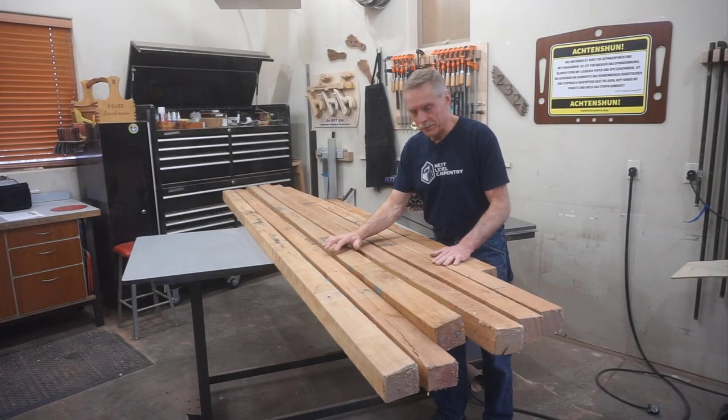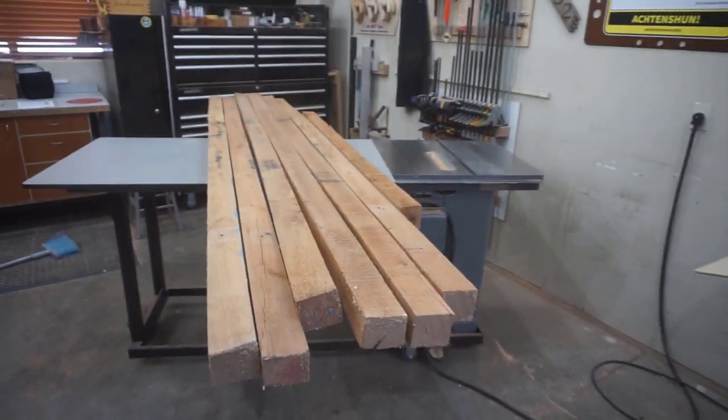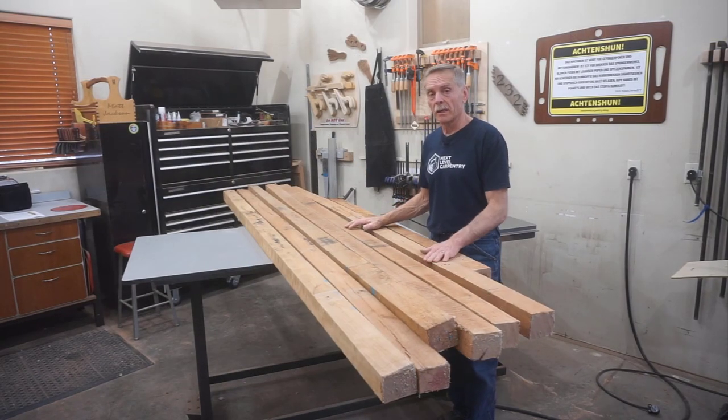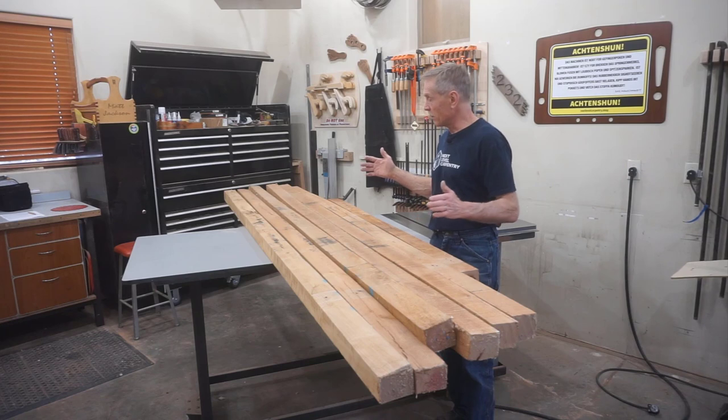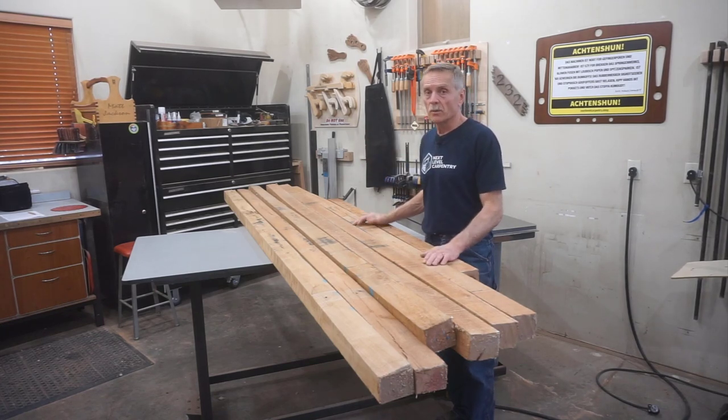Well, the warp, twist, bow, wane, checks, cupping, and everything else with this lumber makes it a bit of a challenge to work with, but it's great raw material for a project like making this jamb. The jamb has thick and thin sections, a number of places that are easy to disguise glue lines, so I'll be able to select through this lumber, pick out which piece will make the best fit for which part of the jamb, and just move forward.